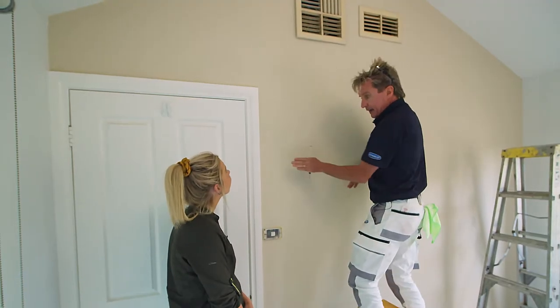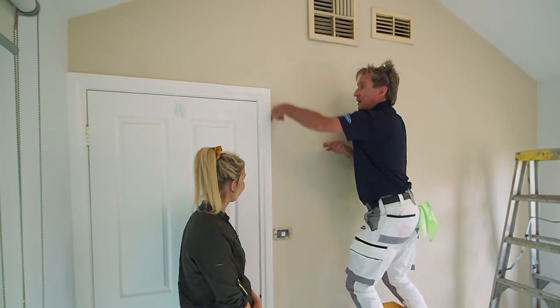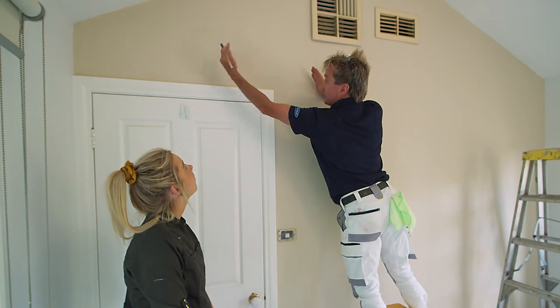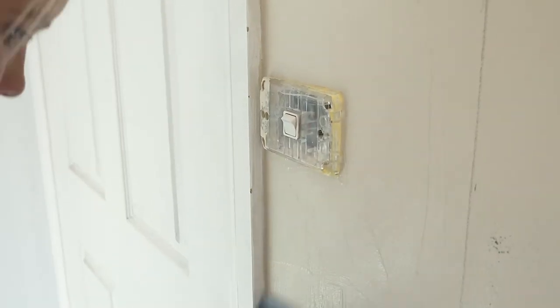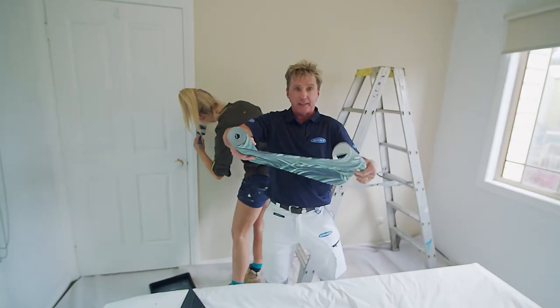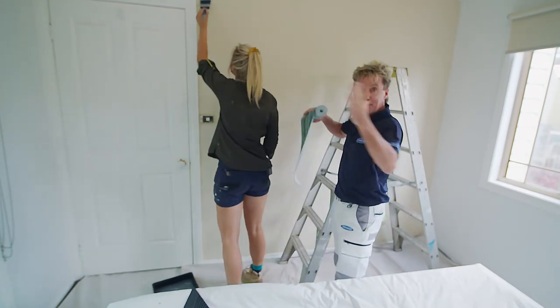The reason I'm not putting my first sheet right up against the door frame is that the line looks like it's continuing the frame. To get rid of that, I'm going to hang the first sheet over the top — the joint will be over here and you won't even notice it. Now the beauty of this wallpaper is unlike old conventional paper where you had to paste the back of the sheet, which is really cumbersome — you don't paste the paper, you paste the wall.